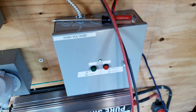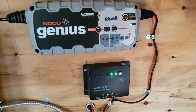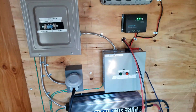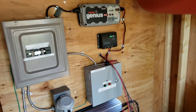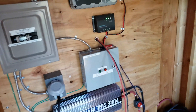It'll do that whether you're on the inverter or generator going into the house. Now this is charging the battery and you can either manually shut it off and it goes right back to solar, or if the generator runs out of fuel it automatically transfers back over. That way, if the generator fails or runs out of fuel, it will automatically reconnect the solar panel charge controller to the batteries and disconnect the AC charger.